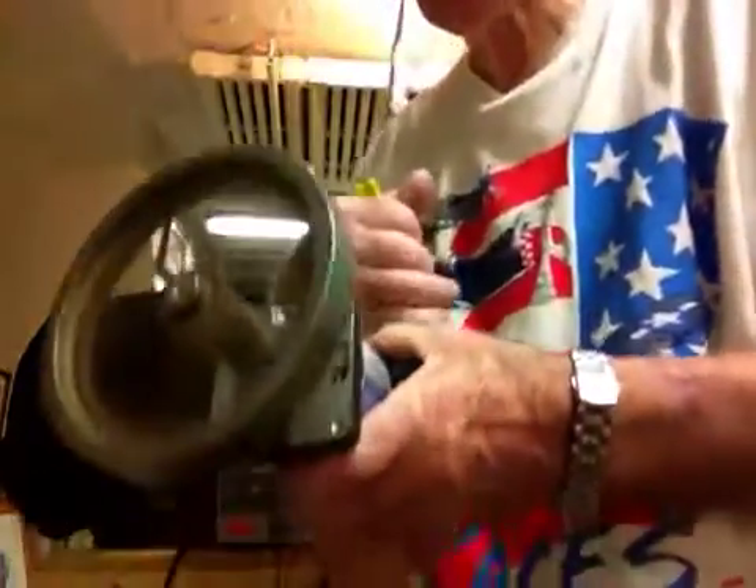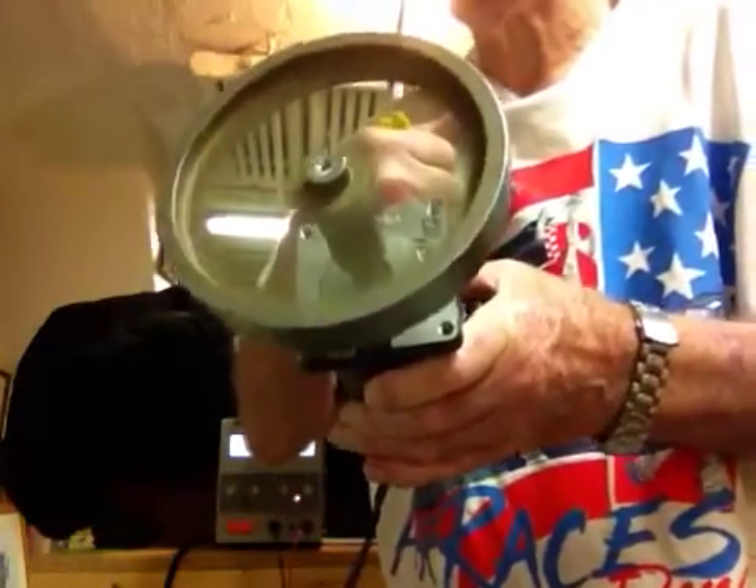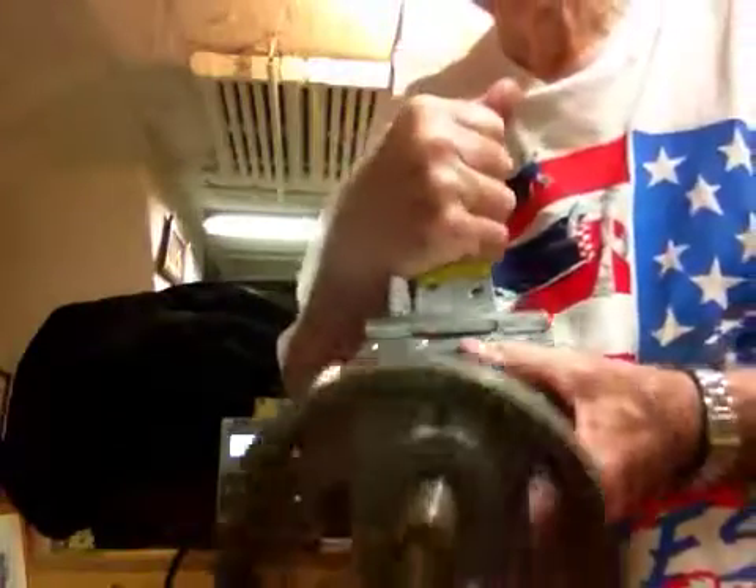So now we turn this voltage up and we get 24 volts, 4200 RPM, 1.5 inch-pounds, 1.5 pound wheel spin, and now we have natural precession, always at this pivot point — natural precession.